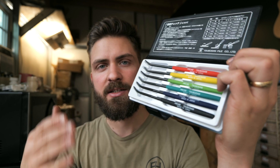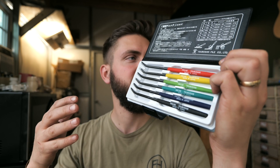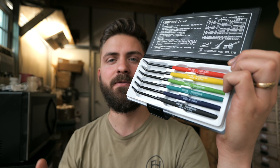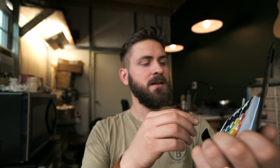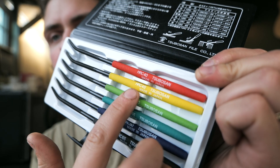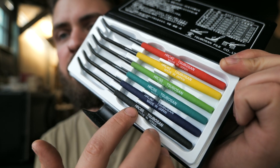This is not going to be as good in general as a Rockwell tester that shows you the exact Rockwell hardness of your knives. But these are hardened precisely to 40, 45, 50, 55, 60, and 65 Rockwell. You can take these and try to dig into your blades with them. Check right after heat treat — grind off all the decarb — then use these files to see what your range of hardness is.